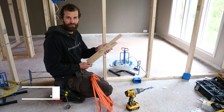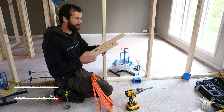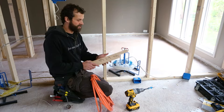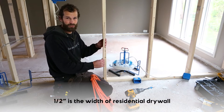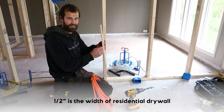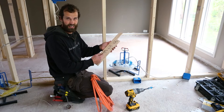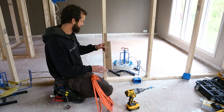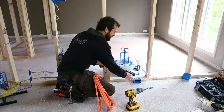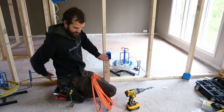I'm Joel Walsman, CEO and Master Electrician of Jefferson Electric. We visited this in an earlier video, but I wanted to expand the body of knowledge. This is my jig made of half-inch plywood — half-inch being a critical dimension matching the thickness of residential drywall. I've written on it in King Sharpie so that it doesn't get thrown away during job site cleanup, and it's going to facilitate me in locating the proper height of my single-gang nail-on box.